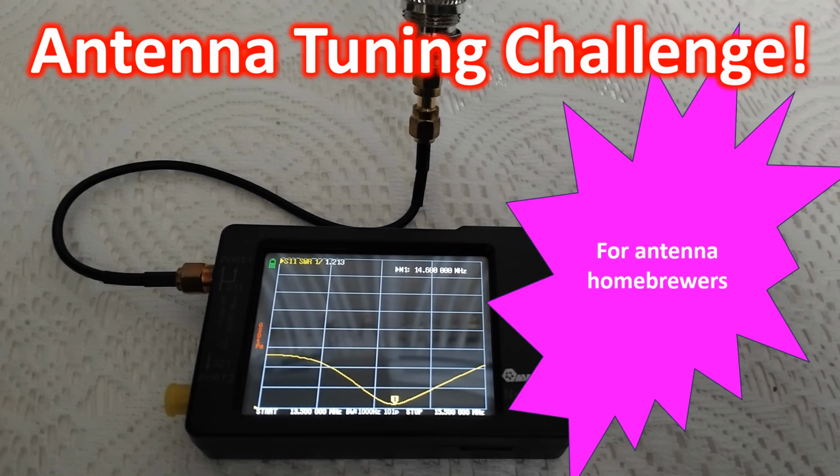Nano VNA tracing showed SWR of 1.213 at 14.680 MHz for a 20 meter center-fed dipole antenna. That was quite above the 20 meter amateur radio band. I wish to make it resonate for 14.075 MHz.